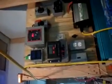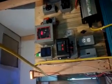My charge controller just turned this fan on, so I guess it's pulling a pretty good amperage. I'm pulling, with the lights on in every room, somewhere around 9 amps right now. So 9 plus 23, I'm probably putting into the bank about 31, 32 amps. A little bit later on, I'll plug in the freezer when I actually have a checklist.